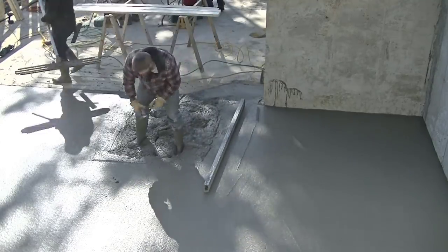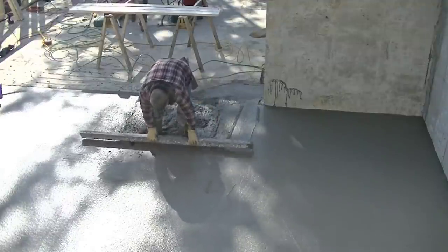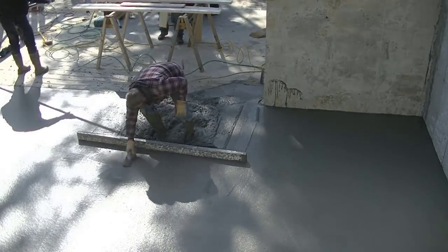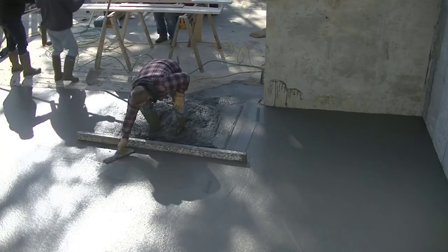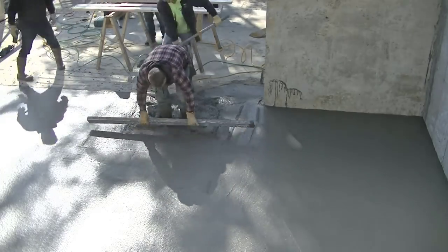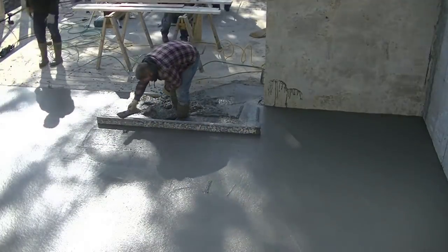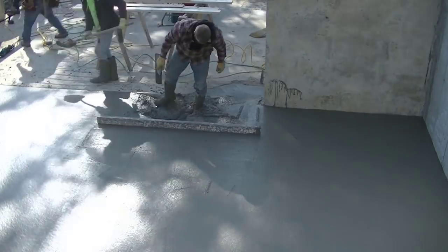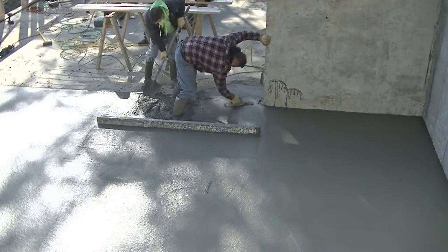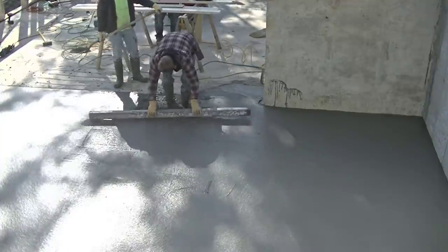I'm up top with a concrete hose making sure everything's getting washed up nice and clean, because if you don't wash stuff right away when it's 20 degrees, the concrete just freezes right to the tools in a matter of minutes — that makes it a little more difficult to clean them up after. We had enough in there. You can see I'm shoveling just a few shovelfuls out — I had to shovel out about three full shovelfuls, so that was a pretty good guess.